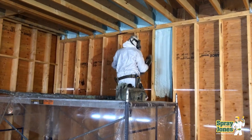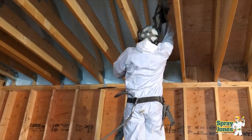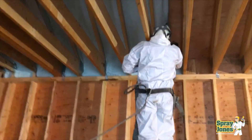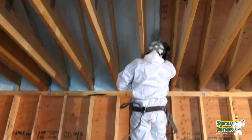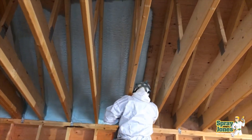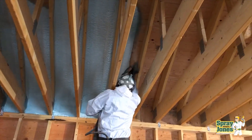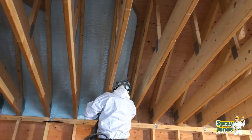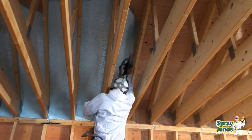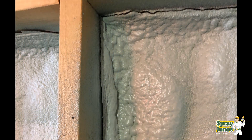We have what appears to be a very clean, dry plywood substrate. You can see the building has got a wrap on it and those walls don't look wet at all. In fact, the foam when you're spraying it looks like it's going on just great. But about 20 minutes after, as the foam starts to cool and contracts naturally — because it goes on warm — as it's contracting, we're starting to hear tick, tick, pop, pop, snap, snap.